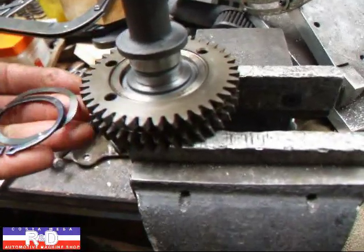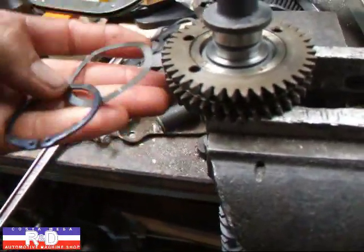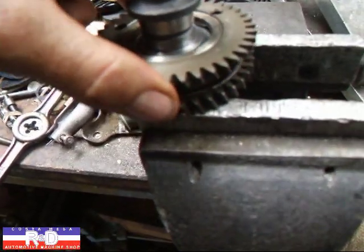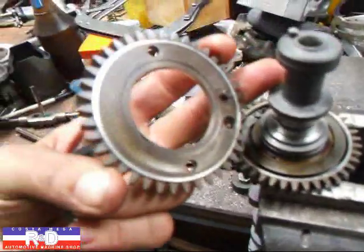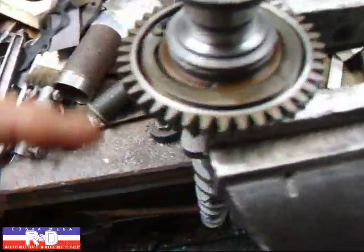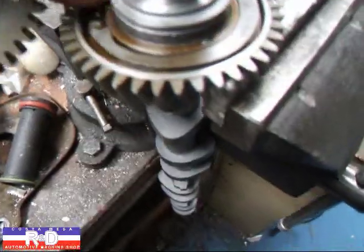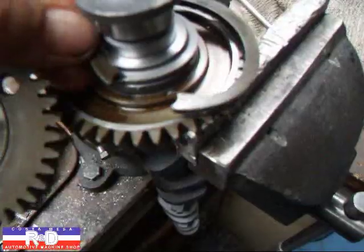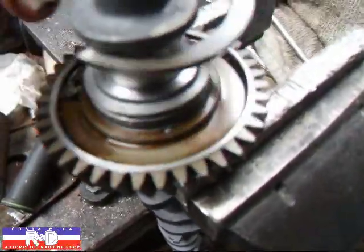There's a snap ring, there's also a washer, a wavy washer that goes in there on top. You take those off and you get this gear off and there's not much on here except a little pin. That pin goes inside of here, and this is the spring that actually causes the scissor action to work properly.